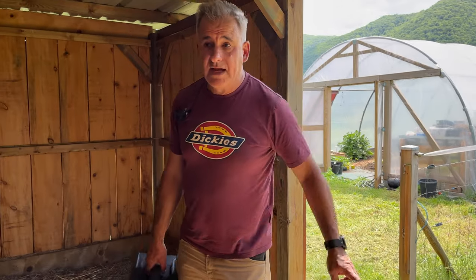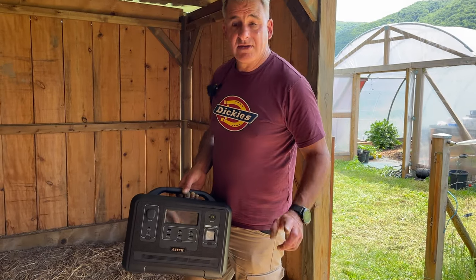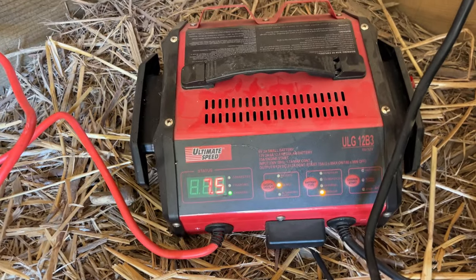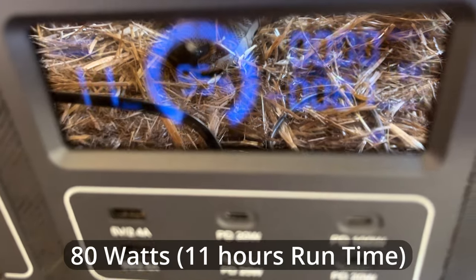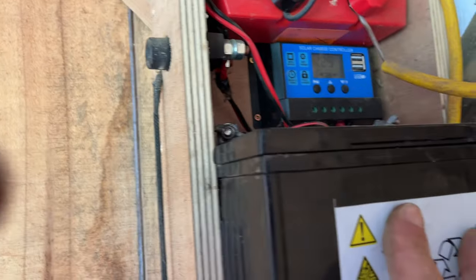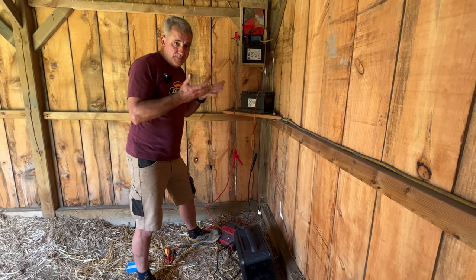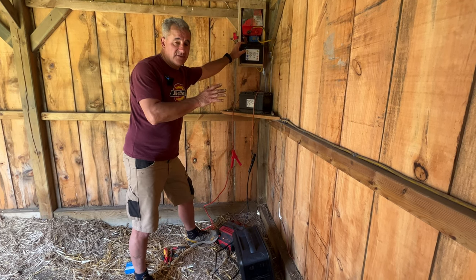The strimming is done. Now we've got a problem with the electric fence. The battery is dead flat. Instead of always bringing that battery back to the house to charge, we thought we'd bring the power to the battery. So we're going to give it a go, see if we can charge it up and get the electric fence back on. So I've connected the battery charger to the Aferi. I've got my battery charging now, and it's only about 80 watts, but there's plenty in there to get this battery up to full charge. Meanwhile, I've got my smaller unit in, and my solar controller is now working. It's been charging for about an hour and a half, so it's popped it up just under 12 volt, so I can get it in parallel with this smaller battery so the solar controller can take over, and that will charge off the solar.